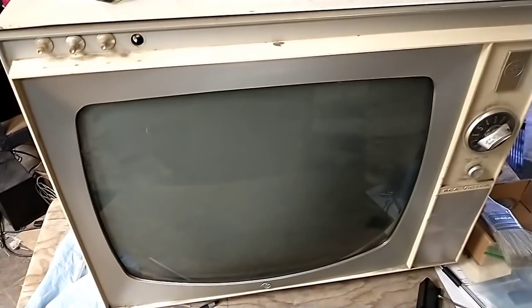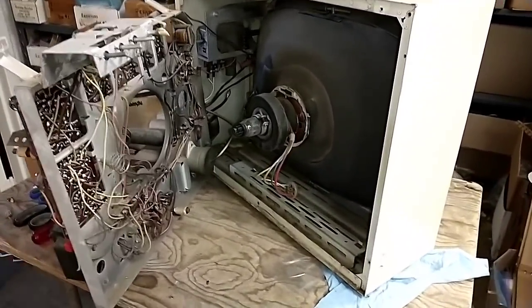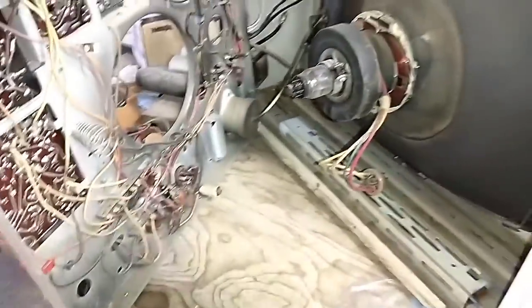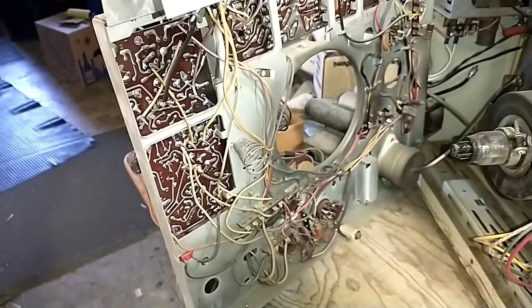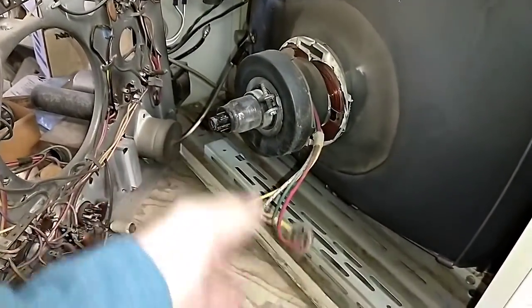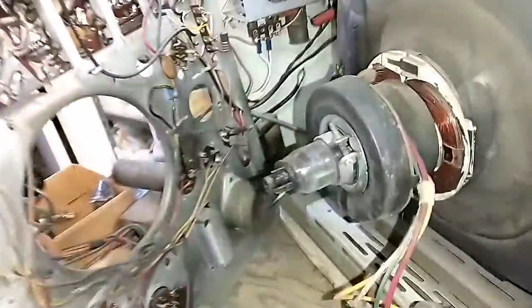This is the set backed out for service. It's easy to get out — just two screws on the top holding it to the chassis and two screws on the bottom accessible from the bottom, and then it swings out like this, which is nice if you just have to do component replacement. On the downside, you have to make an extension cord to run the CRT and the yoke, because the distance between the two makes it so you can't just run it as-is.